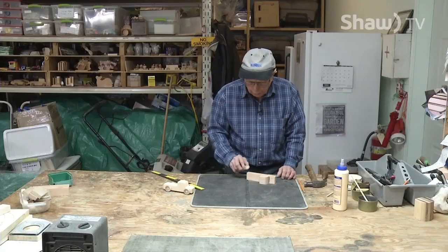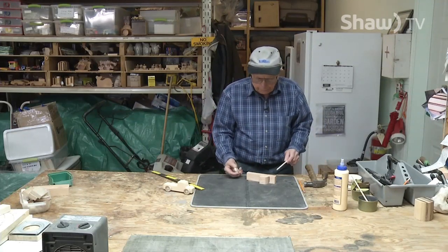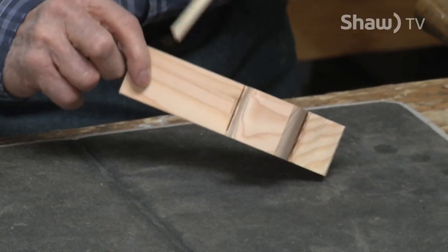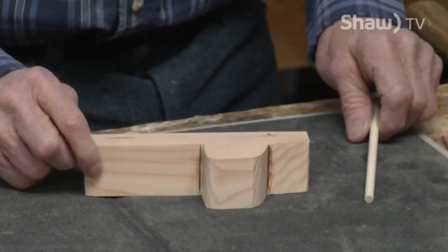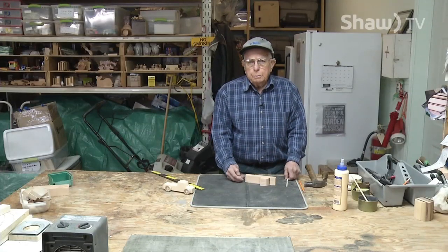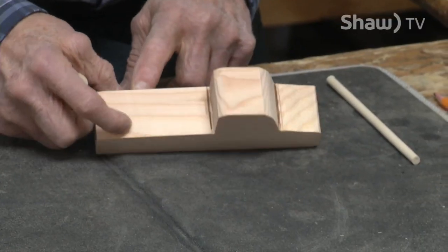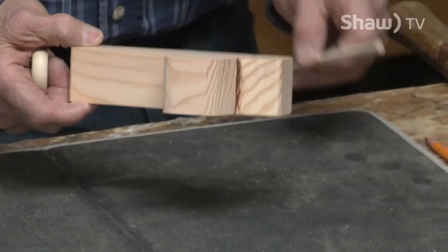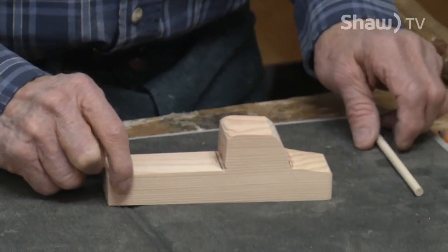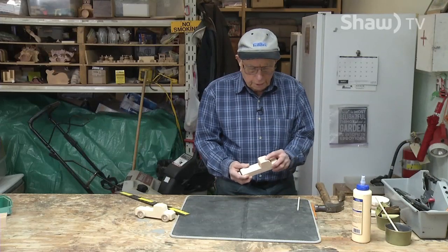Now the wheels are a quarter inch hole and a quarter inch dowel, but you can't just drill a quarter inch hole because there'll be no space for the wheel to turn. So I have to have a bigger drill than a quarter inch, maybe 5/16 or something bigger, so that there is space in here, because the dowel itself will expand slightly, so everything will run evenly. So I'm going to put the drill press on right now.